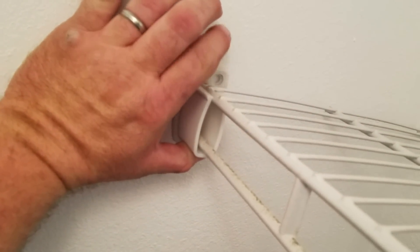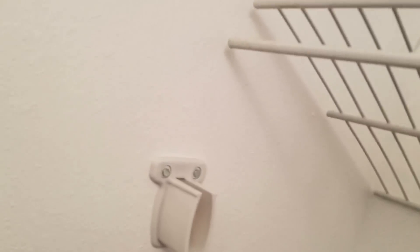I've got it there and I'll mark these two holes with a pencil. Still using my quarter-inch drill bit — I've got the marks here and here, and I'm going to drill with one hand. I just push these anchor clips in and tap them into the holes I just drilled. Then we're going to take a nail and put it in each one to secure it better. That's in — now it sits in there perfectly. We've got to do the other side because it needs something there too.